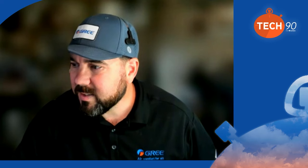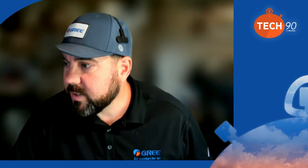All right. Mike, considering a Flex outdoor on an existing Rheem air handler, is a 7/8 suction line size okay? Well, I can tell you the specifications from GREE come at 3/8, 3/4. The first thing I would tell you is if it is applicable, in other words, not too hard to replace that line set, then I'd absolutely replace the line set. Most certainly. Secondly, if you're going to use a 7/8 line set, I'm not going to tell you no, don't do it. What I'm going to tell you is we have had complaints with noise-related issues from the pulsations from the compressor, especially on 7/8 lines.